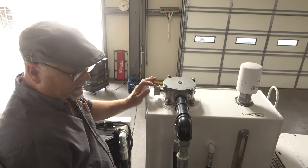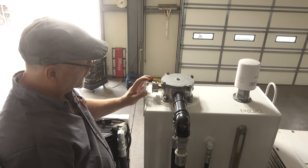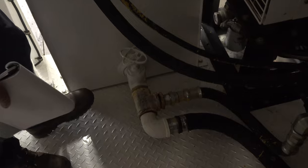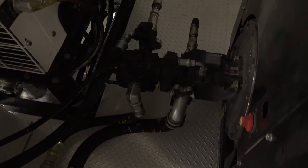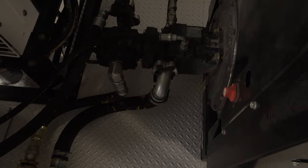By changing fluids and filters unnecessarily, you're just adding more dirt to the hydraulic system. Dirt in a hydraulic system causes higher wear and tear on the components, and you'll be getting poor performance from your equipment. The globe valve on here should be open all the time. If you service something, you close it — but make sure you open it again, because if you try to run the pressure compensating pump with the inlet blocked, you're going to destroy the compensator.